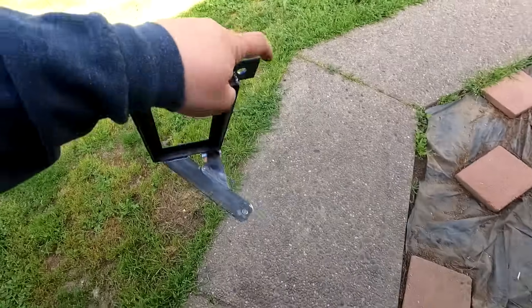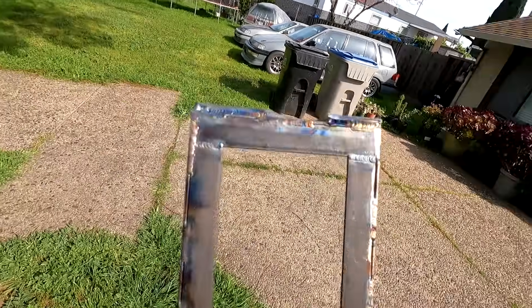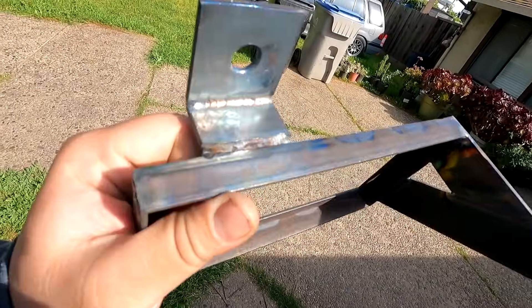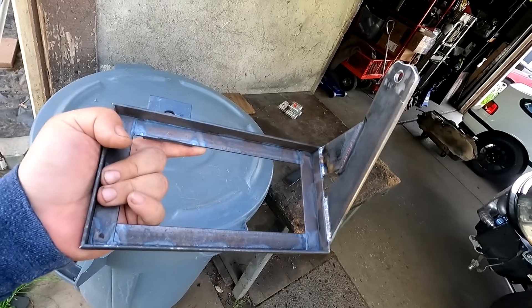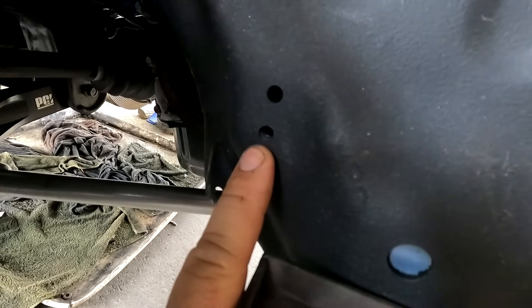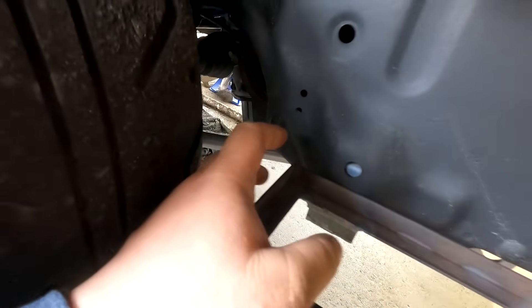This right here is the bracket we welded up last night — I fully welded it rather than just stitching it because I wanted it to have strength. The supporting brackets are fully welded on all side edges. Originally I stitched the tray itself, but the supporting brackets are fully secured. I'm going to make the last leg on the tire side, then get this thing painted up. I also noticed a threaded 10mm hole right there that I could use — it's a little low, but with this bracket it should be sturdy and perfectly fine.